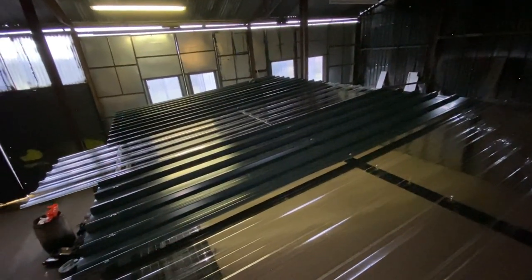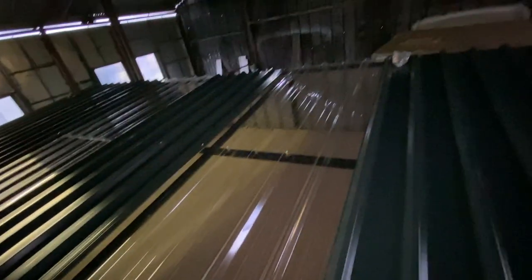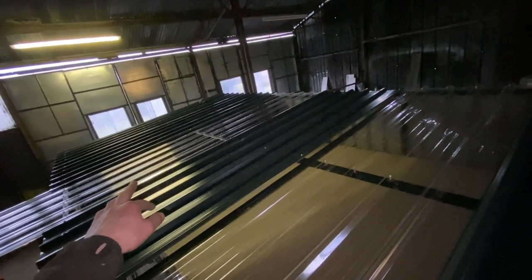I'm just up on the roof, about three quarters of the way through. I want to talk about this clear cladding — it's not ideal stuff because it is quite light; you cannot walk on this. I can walk on the steel ones, but definitely not the clear ones. The trick I'm doing is I'm overlapping the tin on top of this on both sides — the heavy cladding goes on top on each side. I'm screwing it everywhere I can so that this is supported as well as possible, because it is quite flimsy. As long as it's well secured and the wind can't get in under to take it off, it'll be totally fine — it's absolutely great for letting in light. I can only really put three clear sheets on it. There are eight sheets long in total, and three is the maximum I can get in without compromising the stability of the roof.